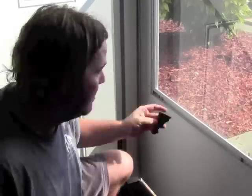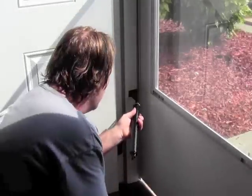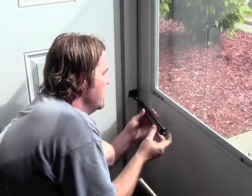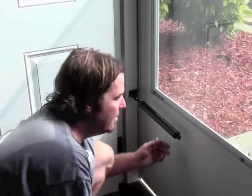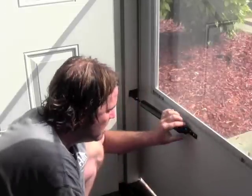Now that we've got our handle on, we're ready for the storm door closer — this is the part that gives most people trouble. We're going to take our storm door bracket and screw it to the jamb. It's printed on here which way it goes, so there's no way to put it on backwards. Point it toward your new storm door and it says put it a quarter inch from the track. We'll tack it in with little screws until we're sure it's in the right position, then secure it with the longer screws. Door closer, our stop, small pin — put the small pin in. Now here's where it gets tricky: position the mount on the door. We're going to pull the door closer to give it a little tension, slide our stop over — now we've got tension on the door closer. This will ensure that it pulls it tight. Place the mount, mark it. Large pin goes in the bracket. Secure the screws.